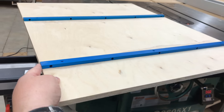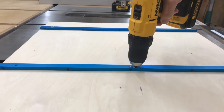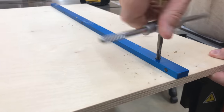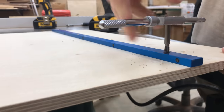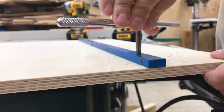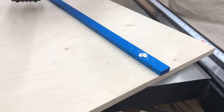There are a couple of different ways I could have chosen to make this attachment permanent. I thought about a wood screw, but my plywood is only half-inch thick and a good portion of the screw is devoted to making the point, which substantially reduces the available thread length. So I decided to drill all the way through and tap it, then send in some machine screws — that way I get threads throughout the whole half-inch thickness. A countersink bit ensures the screw head stays below the surface of the aluminum so it doesn't rub.